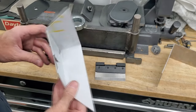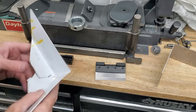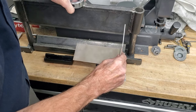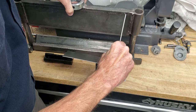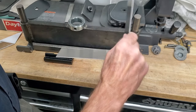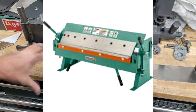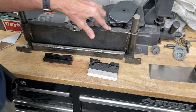What I'm finding is the trickiest thing to learn about all of this is interference with the die when you're bending. That is when you're bending an adjacent bend — this way. The interference with part of it — this is like if you're making boxes and stuff — interference with the die itself. So you end up having to have longer fingers for it to clear. I've looked into getting one of these box brakes — the kind that have the fingers that go down and you bend it up.